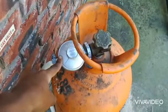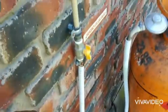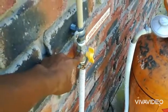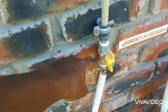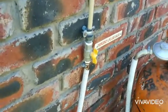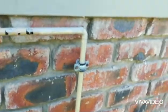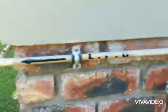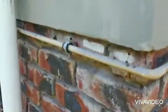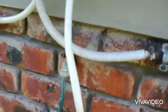The regulator will feed the unit with the right demand of gas, and there's a shutoff valve down the line that will also need to be put in for safety — in case of an emergency you just switch it off. Your gas pipe color must be light stone for the LP gas line, so that people know not to mess with or cut that line.